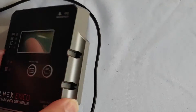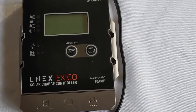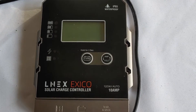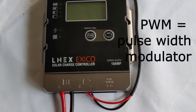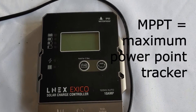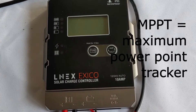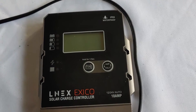It's really thin for what it does and I like that. It has a nice LCD display. It's 12/24 volts, so it's a PWM charge controller — just so you know, it's not an MPPT. It's a PWM. Some folks think less of those, so you should know that.